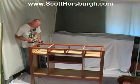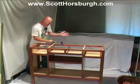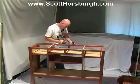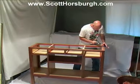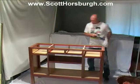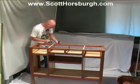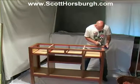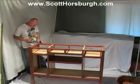So I'm going to start on the inside. Use my hand as a fence, my fingers as a fence here, while just having my thumb on the hand plane there. And I'll walk it through. And when I get to the corner here, I can just turn. So I can keep going and come up there. Always check.